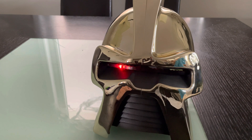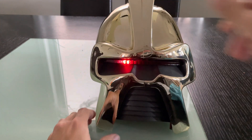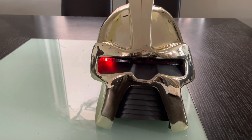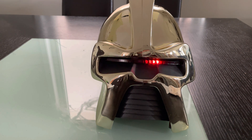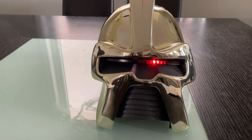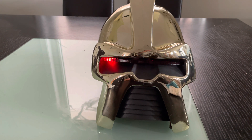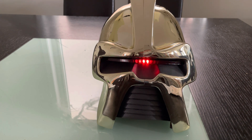It will go off and on, periodically running as it does normally when you're wearing it — that gives you an idea of how long the intermittent phase is. Moving to two lights, you can now see that there is a trailing effect behind the lit LEDs. They're lit at half power — you can see two or three LEDs lit behind it and one coming in dimly before it, which simulates the original Cylon costume bulb better than a single LED. It's a subtle change that gives the bar of light a little more length and a trail-out effect.